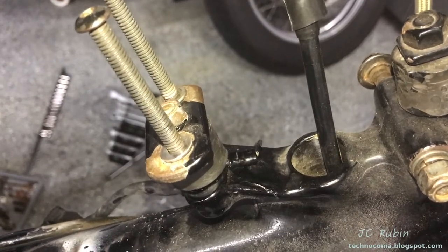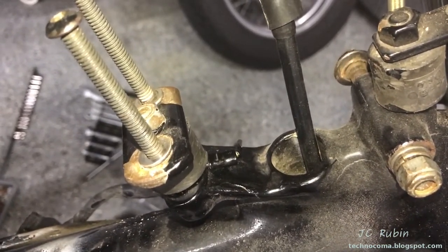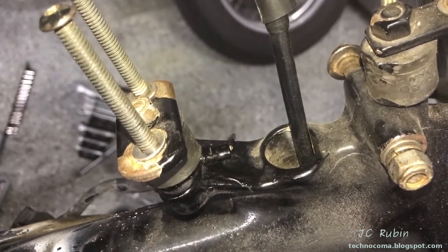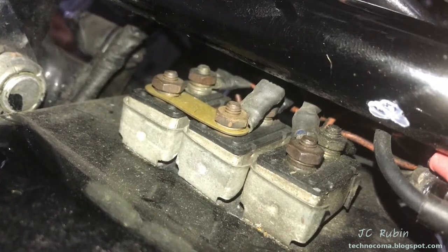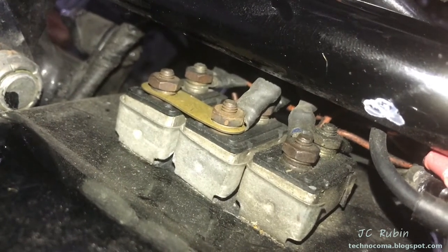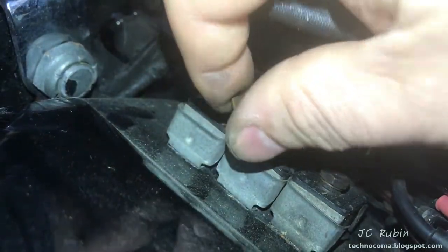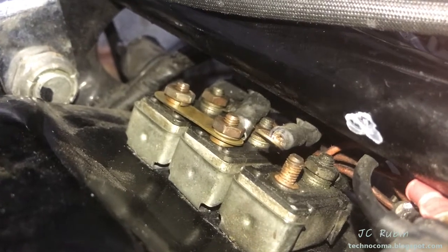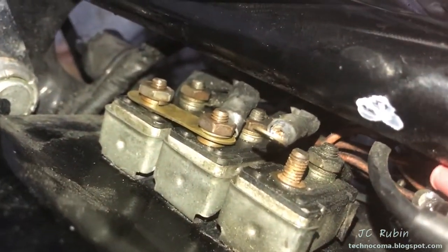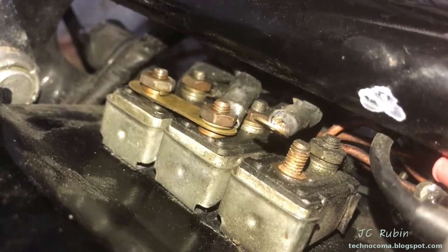This connector is in good condition and will be reused. We're going to clean up the metal mating surface on the bottom of the dampener for good contact. The metal shined up nice again. I've got the ground all shined up, the threads cleaned out with DeoxIT, working it in and out to distribute it. I'll be reconnecting that ground. Grounding issues on these old bikes — or any electrical problems — can take forever to find. Going through each wire and cleaning these connectors actually saves a lot of time in the long run.